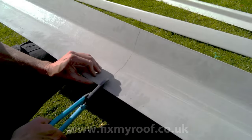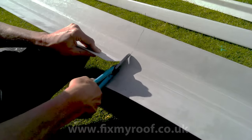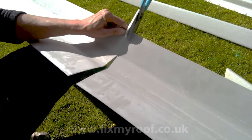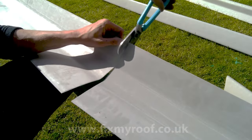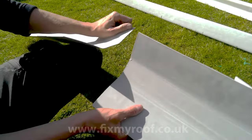For fiberglass trim cutting I use a nice set of sharp Gilbo tin snips wherever possible. This is because there's hardly any dust kicked up when using this method, and I'm doing exactly that here cutting a D260 fillet trim which we will be using later. No dust is created and the finished cut is superb.